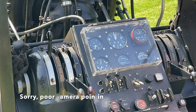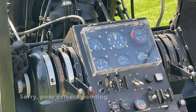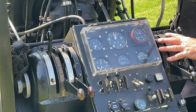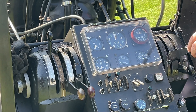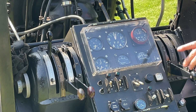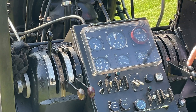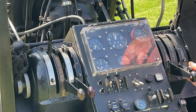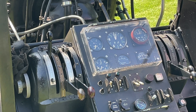There's a panel switch giving me 24 volts, a total run clock giving the total elapsed time the magneto has been live on this trailer, a charge current switch, a safety cutout switch — big red knob to stop it — and a safety relay reset button. On the right quadrant there's the fuel cutoff lever, which goes to idle cutoff — that's how I stop the engine, by starving it of fuel. The other lever is not used on this engine; it would be used on early baby Merlins which have siphon cutouts on the carburetor.